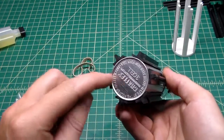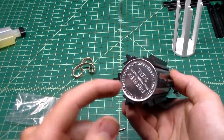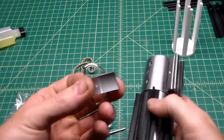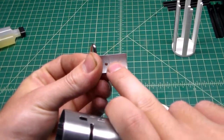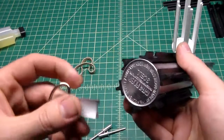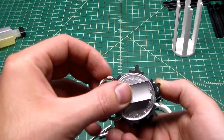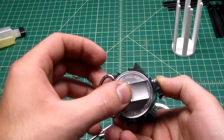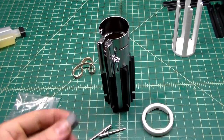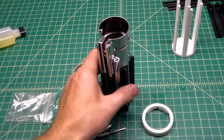And what I do is I drill the 2 holes for the 2 rivets, and then I drill, and you can either Dremel or I use a milling machine, a slot underneath the long part of the D-ring that kind of fits the same shape as that, and that's just for sound venting. If you're going for an FX saber with a speaker. But yeah, that'll be it. So I'll let this cure overnight. I'm not going to demonstrate how to do that. It's very basic, but that's about it, folks.